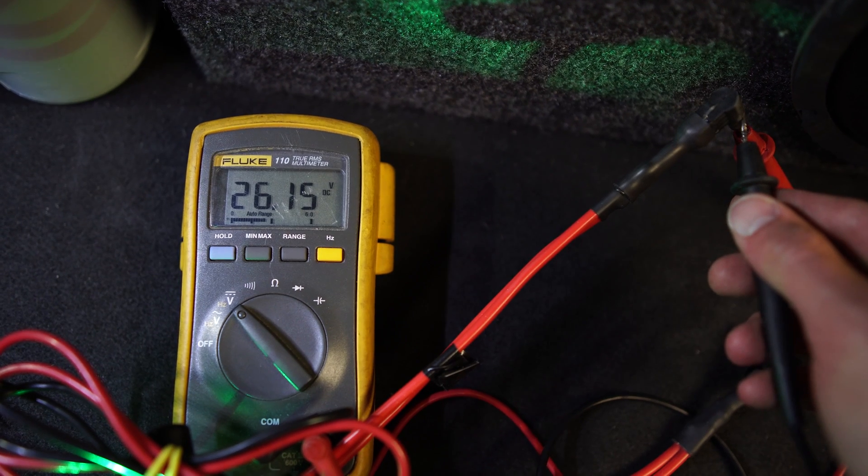There's technically an adjustment on there but they've adjusted it to 26.1 volts and just glued it so that you can't adjust it. Now these things don't have heat sinks on them, but I attached some heat sinks just in case — even sitting at idle these chips started to get a little bit warm. So if you were actually using this as a car charger it would get pretty toasty, and with no heat sinks it's just in a plastic casing. It'll last a little bit longer and run a little bit more efficiently with the heat sinks.